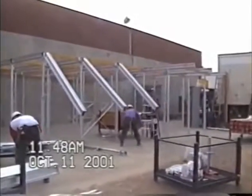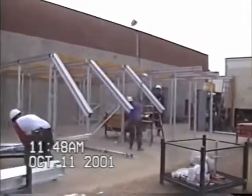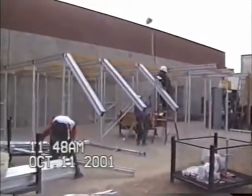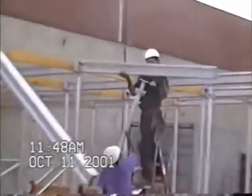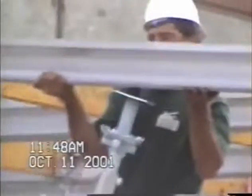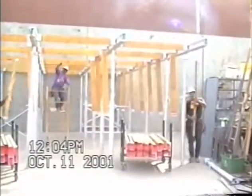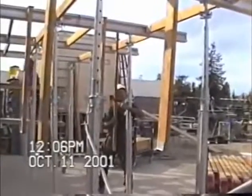The post shores are attached to the ledger by using a plastic positioning spud, which can fit anywhere along the ledger. Once the gridwork and posts are set, all of the intermediate joists are hung from the ledgers and are ready to be set in place.